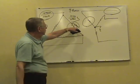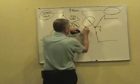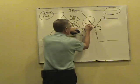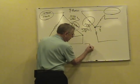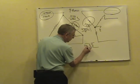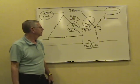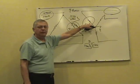Okay, if we got 480 volts in the phase of the primary with a 4-to-1 ratio, to get your secondary phase voltage, take that 480 in the primary and divide it by your turns ratio of 4. You got 120 volts in the secondary. See, these two windings, they're sitting there like this. The 480 is over here. With a 4-to-1 ratio, you got 120 over here. Like that. Okay, now we took our 480, divided it by 4, and got 120 volts in the secondary.